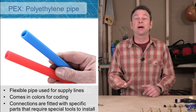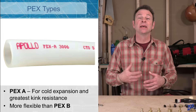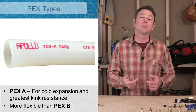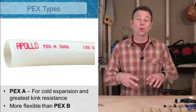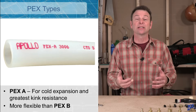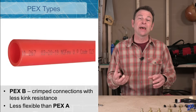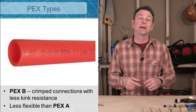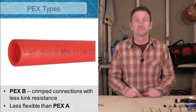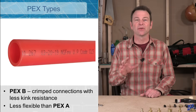There are two types of PEX pipe: PEX A and PEX B. PEX A will stretch more than PEX B, which means that if you freeze the pipes they won't burst as easily. With PEX A we can use a process called cold expansion — we stretch the end of the pipe, push the fitting in, and the pipe shrinks around it and seals up. PEX B is a different system using crimping: we put the fittings in and then crimp a band or ring around it to make it seal. PEX B is less flexible than PEX A, which is why we use it for the crimping process.